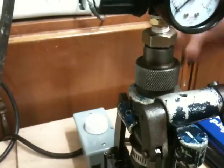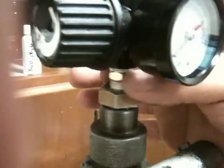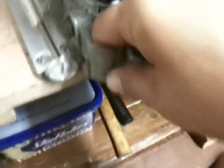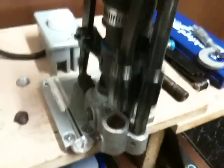And there you have it. There was no pressure inside the tube until I added air, and I haven't even fully tightened it yet — so I can tell I'm getting a good seal. The vent port is not leaking. I'm getting a whole bunch of lube curled up in there. This is hard lube, but it's really softened up enough so I can use air pressure to push it. Instead of manually cranking, we're just trying to maintain pressure in the lube cylinder system. There is lube coming out — it's a constant pressure.